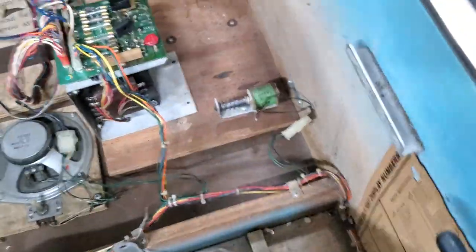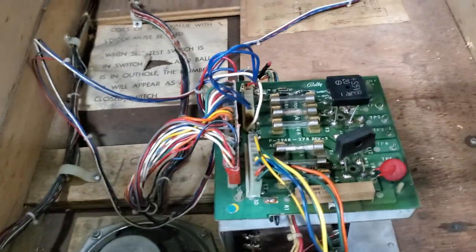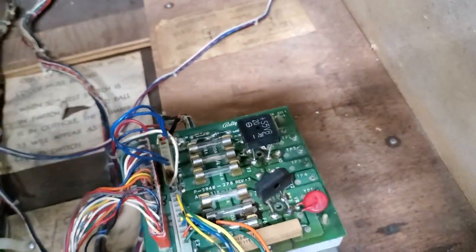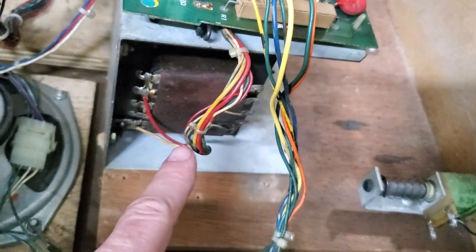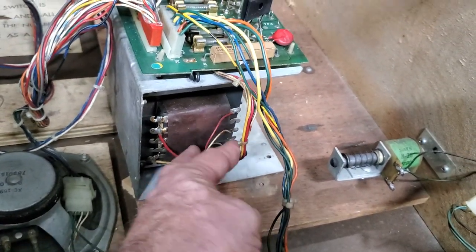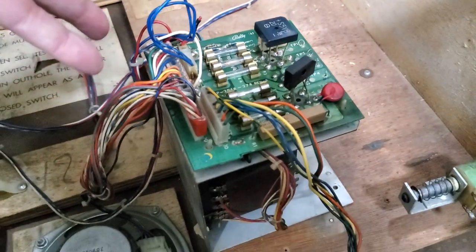There are burned cables everywhere. We're going to replace it with a brand new board — we're going to pull all of these wires that are soldered onto the back of this board, cut them off, solder them onto the new board, and then repin all these connectors. Along the way I'll be checking to make sure everything lines up, because these are all power lines. You should never assume 100%, so you want to look at the transformer diagram corresponding to the color codes here, corresponding to the voltages on the board — just in case somebody replaced the wire, or even from the factory they used a non-standard wire color. This varied from game to game, model to model, different time periods. That's going to be the most time-consuming part because you kind of have to lean over into the cabinet — this is not something you can really pull out of the game and work on, at least not easily.